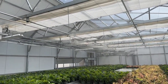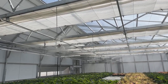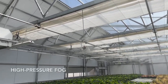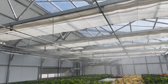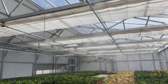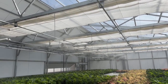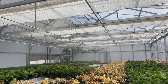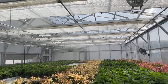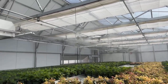The fogging system has just turned on. You can see it's high pressure fog — it's actually a stainless steel line with stainless steel fittings. The idea is that the molecule size is so small that it never really becomes wet in the greenhouse, but it's only adding humidity. We also use our airflow fans to help move this around.